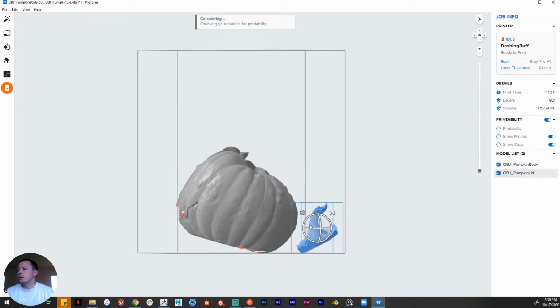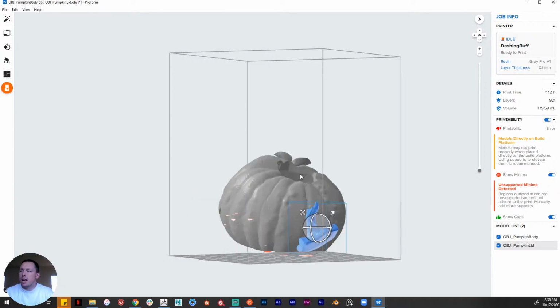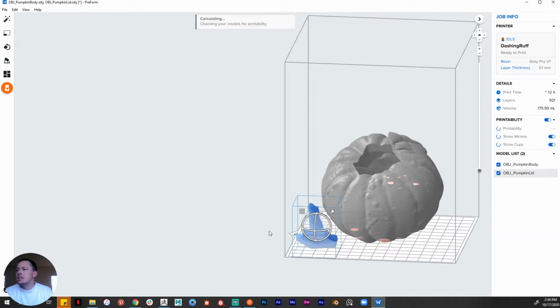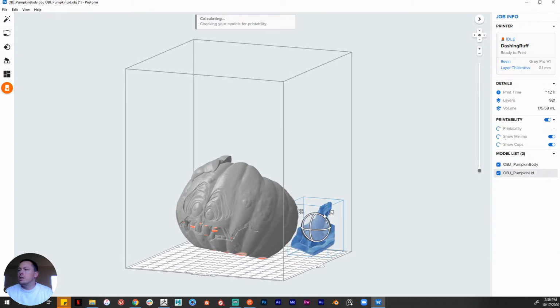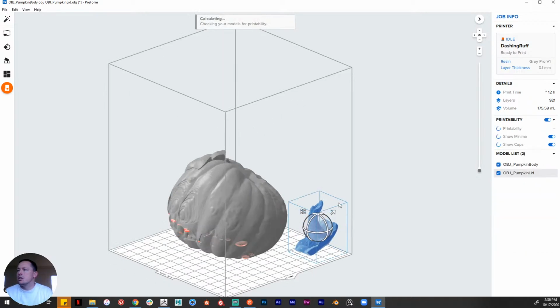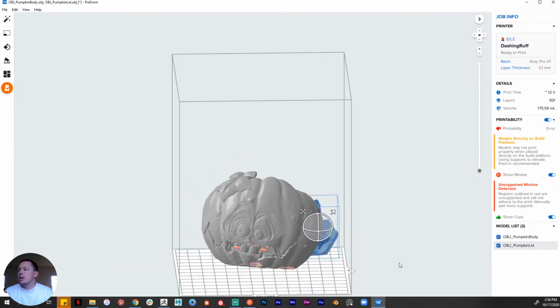For instance, the bottom of this lid, if I were to have it more flat with the surface, I would get some dipping. So what I want to do is have it angled so that the supports will come in and essentially take care of it as much as possible. Create wedges and create. Yeah, maybe let's tilt it this way. Something like that. Okay, that's working.